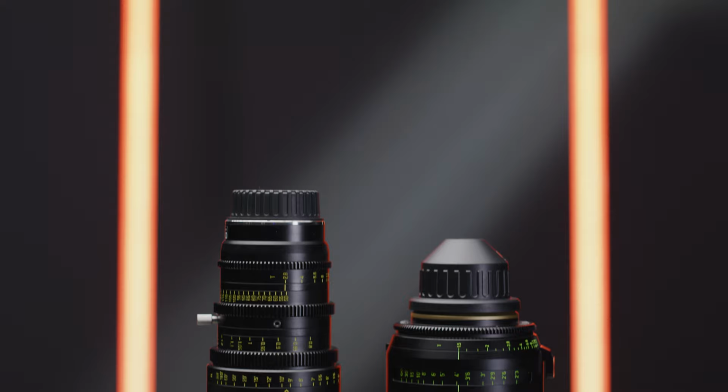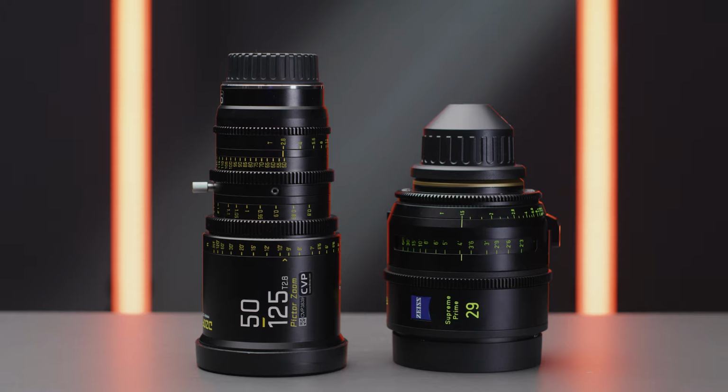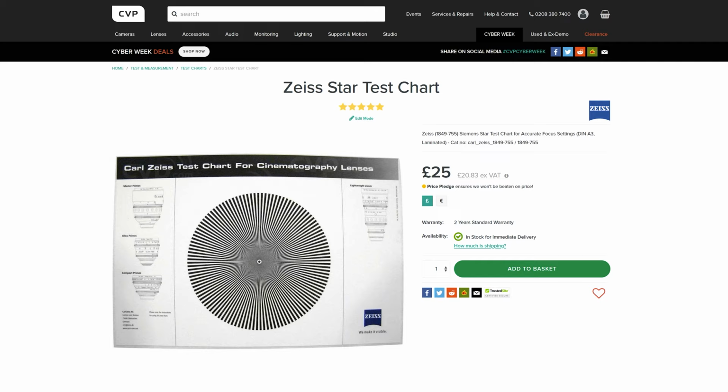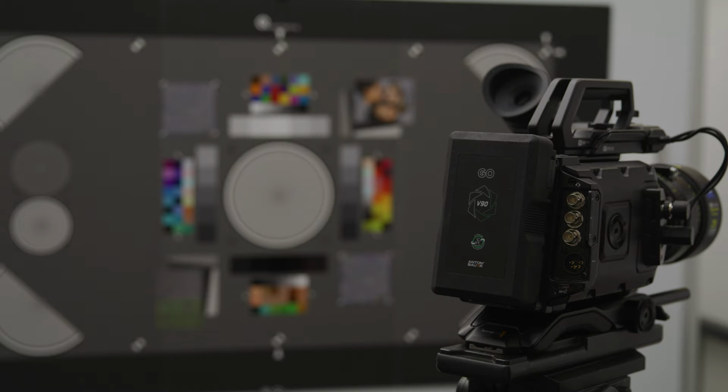Let's start off walking you through how to shim a prime lens, then we'll look at a zoom. For our examples here, we have used a Zeiss Supreme Radiance and a DZO Pictor Zoom. Grab a focus chart. We've put a download to one in the description below, but you can also buy them, which we've also put links for in the description, or even just use a newspaper if you really are on a budget.